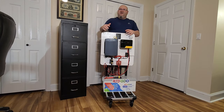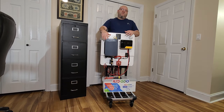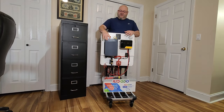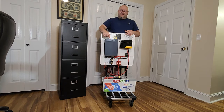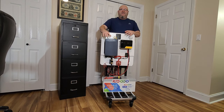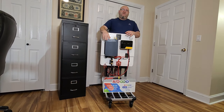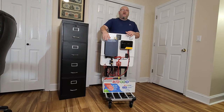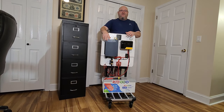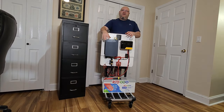My thinking was, just for cutting down on your electric bill — I could run a window unit. And that's what I've been doing all summer long: running a window unit off this inverter. I've been running a 12,000 BTU Midea inverter air conditioner every afternoon. It helps cool the house down and has actually lowered my electric bill to under a hundred dollars a month. Several months my electric bill was like $70–$80, so that was pretty impressive.